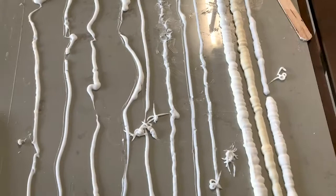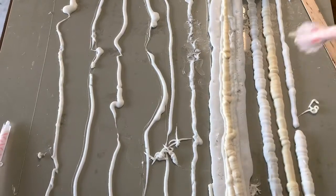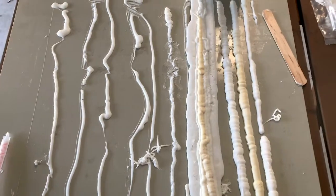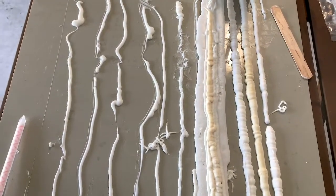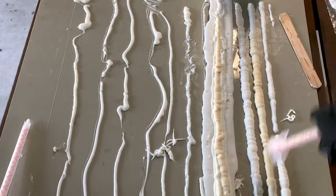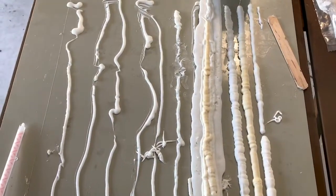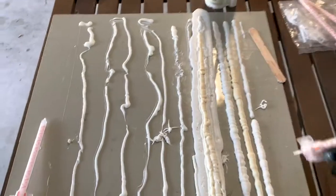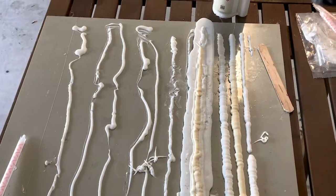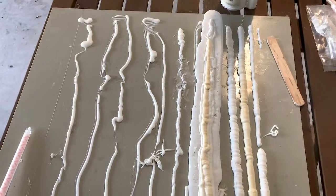And like I said, that's actually done the same thing twice on two different days, same faulty process, same faulty adhesive. And just to really hammer the point home, in that last video, after having discolored resin, I had to finish off the glue in the tube before I put it in the bin anyway. So what I did was, you saw I took the old mixing nozzle off, purged it, so I've reset the height of the plungers, and then put on a clear mixing nozzle, purged it, so I've done the proper process.